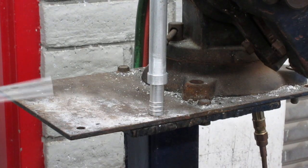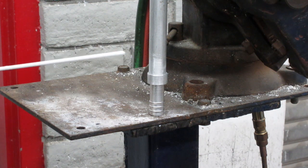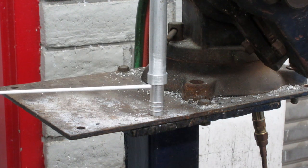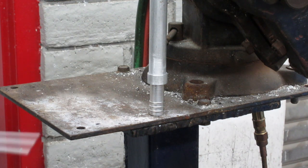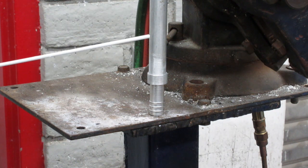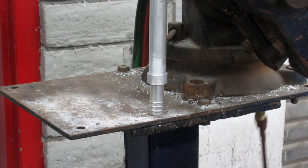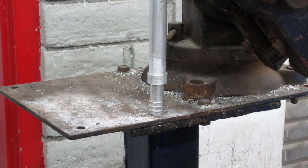We're going to weld an aluminum AC hose barb to a number 12 pipe. We've sanded the pipes and there's a good tight fit to conduct heat thermally, so they'll assist in the welding and we don't have to preheat one section more than the other. We have our welding rod and regular brazing glasses. We'll go ahead and light the torch and weld this up.